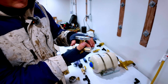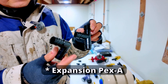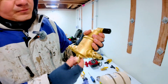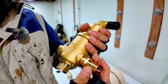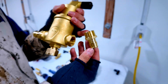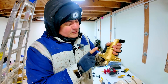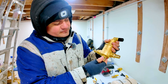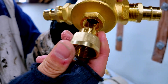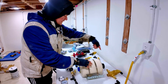We have some generic expansion PEX components — a T and a 90; nothing special, they're easy to find. Talk about our aerator — this removes air. One thing I found interesting: because we're using PEX, we're having to buy converters from three-quarter inch brass to expansion PEX. Very important that you look for expansion PEX and not get the PEX-B type — don't make that mistake. This aerator has a bottom connection that is actually a half-inch brass connection, so I had to purchase a half-inch to three-quarter adapter to connect to our expansion tank. Here's the expansion tank — nothing super fancy — and I'm going to connect those two parts directly.